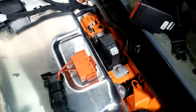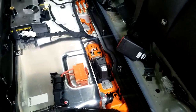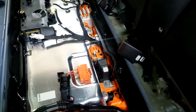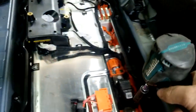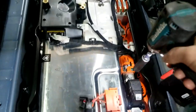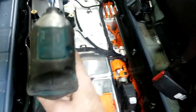The main thing is swapping out this pyro fuse. It's just a 13-millimeter bolt — zap out two bolts, drop the new fuse in, replace the fuse and off you go. There we go, zap out that fuse. I have to worry about power — there's only 400 to 480 volts in this thing.